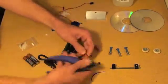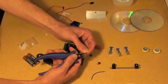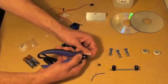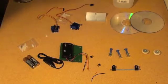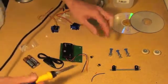Pop that off and then carefully strip these two wires. Strip about half a centimeter off the end. Now we need to tin the wires because it's stranded wire and it's difficult to poke through the hole and get all the strands through.